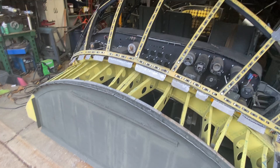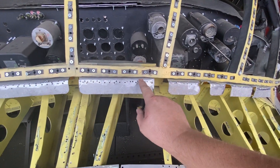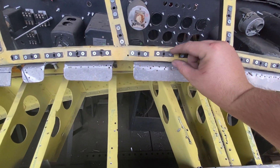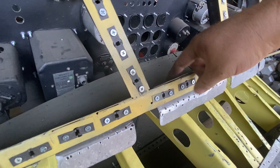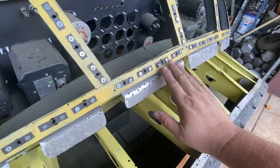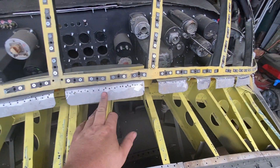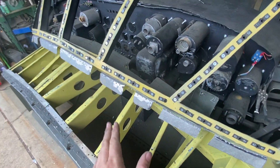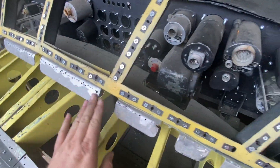Of course, now I know: number one, this is where the fairing mounted. This frame — the steel drops down to about right there, and then it drops down on the other side, forming a triangular shape with an open bottom — so I've got that right. In order to correct this problem I simply need to de-rivet all these from the other side, then weld a piece of steel the entire length. That will give me the true shape of the base of the canopy and a surface to rivet or attach the fairings.